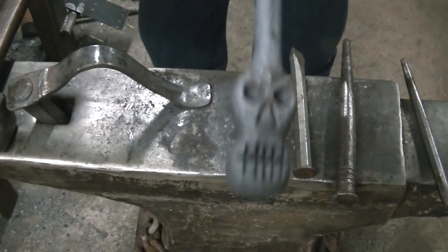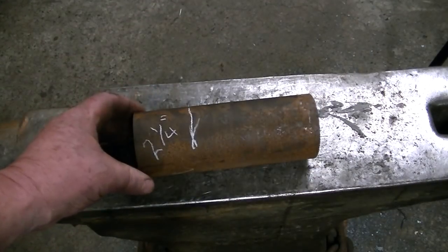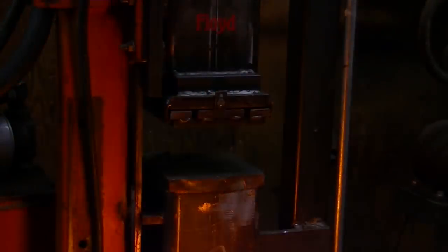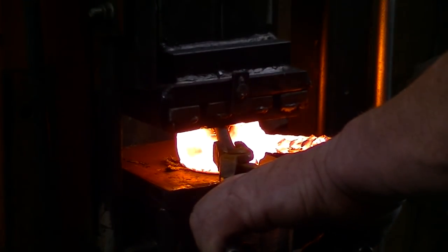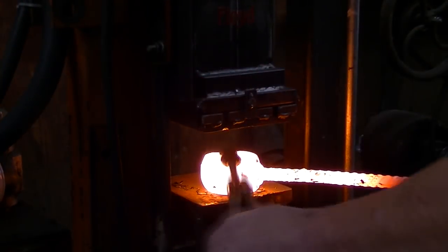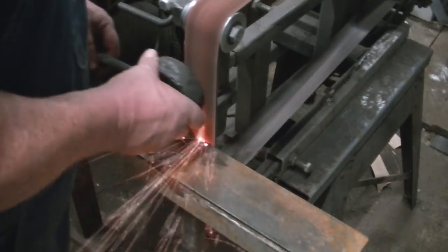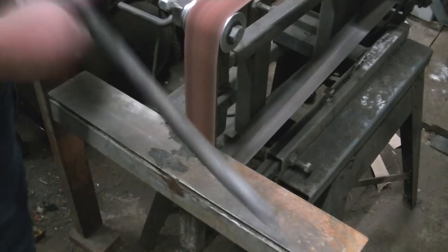We've got our little rounded sculpting tool here — we're giving them some angry eyebrows. Spooky! Now this is a piece of two-and-a-half inch stock, and we're going to cut two-and-a-quarter off of it. We welded a handle on that, and this is going to be our die material. We'll press it down a little bit before we get this guy in there. If you use a power hammer on this it'll drive it down pretty much flush; with a press you tend to get a draw-down around the edges, pulling the material down — ends up being a little bit of a valley. So we're over to Sparky the grinder and we're going to grind those off and make it nice and flat.